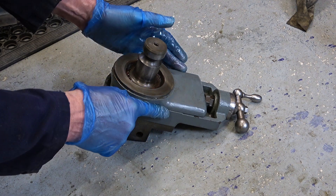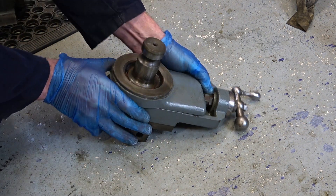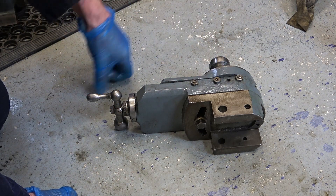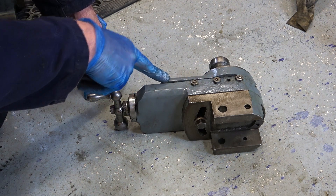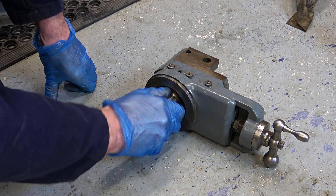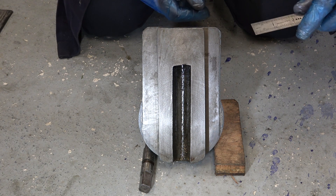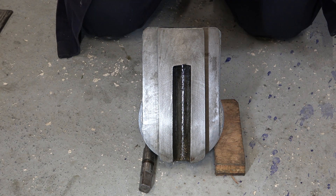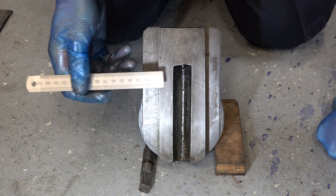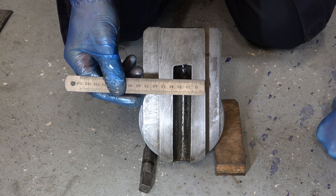You can see that this casting here is kind of sloped compared to this, so there's a gap appearing — it's at an angle, and the reverse on the other side. This is creeping across relative to this, but it still slides vertically and the calibration marks line up — so whether this was just a Friday afternoon job, I can't say. Measuring from the root of that dovetail to this edge: it's 30mm on one side and 25–26mm on the other. On the other measurement: 17 versus 16mm.